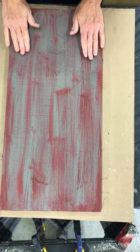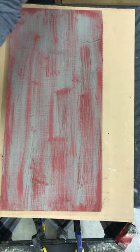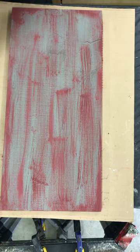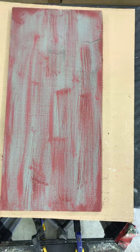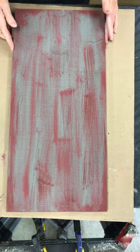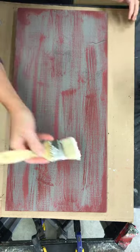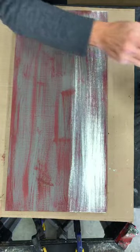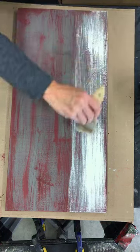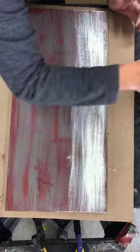I'm liking that already — I think that's pretty good. My next color is called Home Plate by American Paint Company — any creamy off-white chalk-style paint you have lying around is great. And of course I don't have my paint can opener, so I have to use the hammer here. So I'm just going to do the exact same technique — dipping my chippy brush and going up and down the board very light-handed. With the white, I want a bit more coverage than I did with the red.